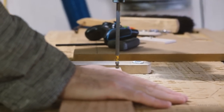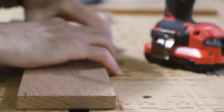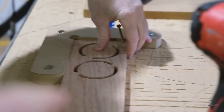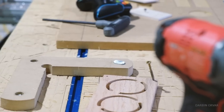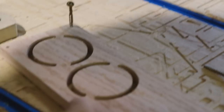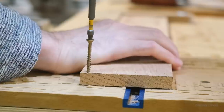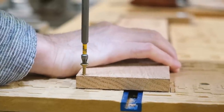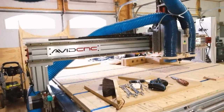If you're securing the material with screws, you can go faster and be more aggressive with your power. Obviously, in order for this to work, the circle that you cut must be right in the center of the wood, because if it's off a little bit, then when you flip it around it's not going to be the same. That means the distance between the edges needs to be identical, or as close as possible. That's the thing about CNC work - it's very precise and it's very fast, but in order for that to actually happen, you need to set everything up right in the first place, and nothing can be just slightly off or else it won't be as precise and you won't get the result you're looking for.